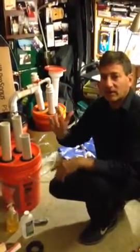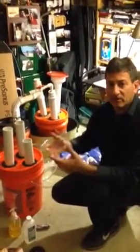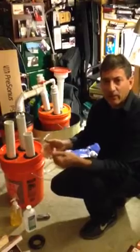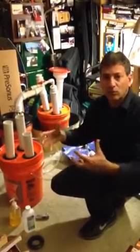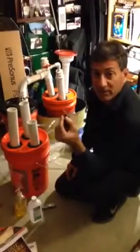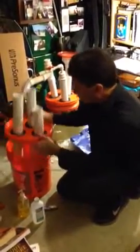And it doesn't matter what the stomach is. It can be a Home Depot bucket, paint can. It can be an IBC tank. It can be some kind of ceramic or clay or leather or cement or steel drum, anything that'll hold water basically with 3 pipes will make a biodigester. This is a very simple one that you can try at home, and when you've done this you can use the same uniseals with your IBC tank. So we use the same size uniseals and the same size pipes, they're just shorter.